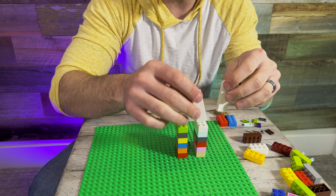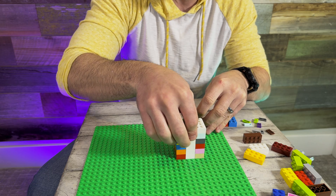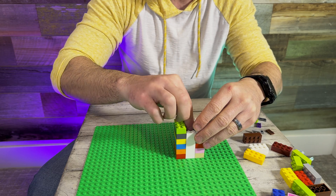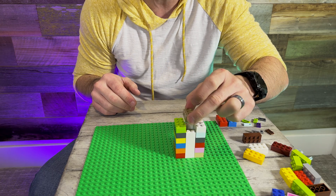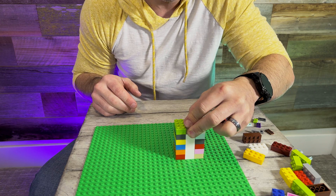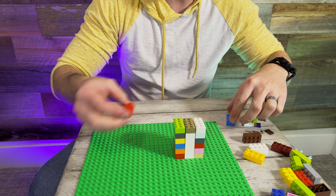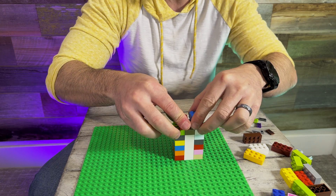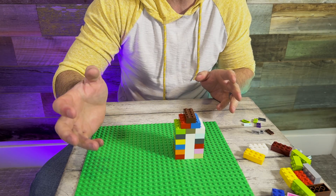And this is the entire purpose of 3D printed supports. We'll do that exact same layer but with supports underneath it — we're going to put a couple of supports in between this area that needed to be bridged. Now when the 3D print head comes through and lays down filament, it's able to do so with no problem, and the subsequent layers above can be printed giving you a nice strong model.